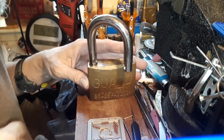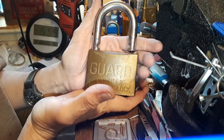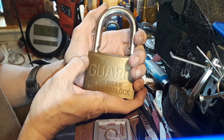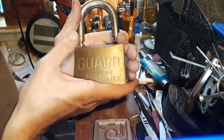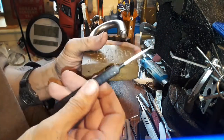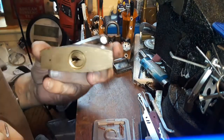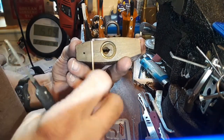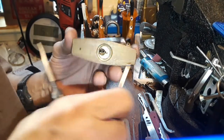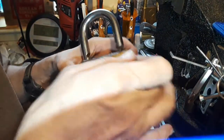The moral of this story is: don't let size intimidate you. This looks like a huge lock — if you saw it locking a gate you'd go, 'I'm gonna need a big bolt cutter, a special hacksaw.' No — all you need is a tiny little pick. It's like David and Goliath. Use the biggest tension wrench you can fit in the bottom of the keyway, and when it goes it might give you a little surprise, like that trampoline effect.